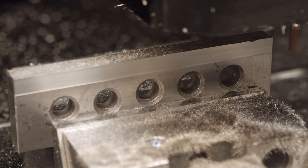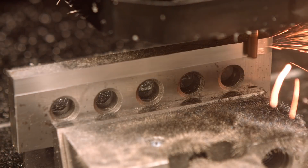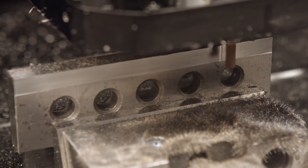I'll go 0.3 millimeter width of cut. And you know guys, it's hardened, so that counts a bit different. Okay, 0.3 and the same stuff. I guess it's a bit too much. So this is the new cut — as you can see, it's shinier. So it's that part in here. Change the focus so you're gonna see a clear reflection. I guess that's gonna be somewhere here.